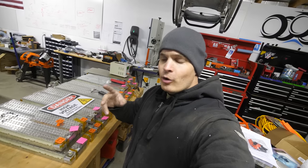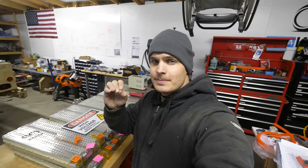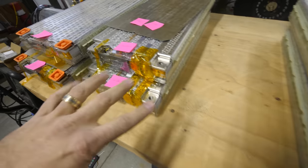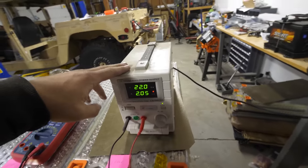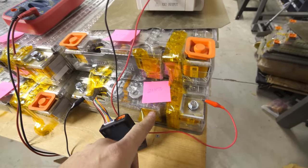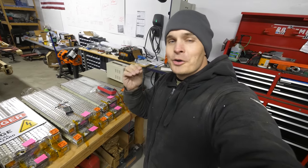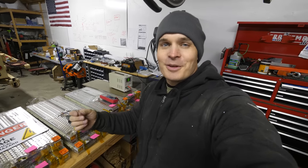We still need to make sure all of these batteries are within the same voltage range, which is an issue because I got them from two separate sources. The first batch were all 24.6 volts while the second batch of four batteries were 21.3. So we have a DC regulated power supply pushing two amps into a battery to bring it up to 24.6, while the cells are being slowly balanced. Fair warning — I'm not 100% sure this is the correct way to charge lithium-ion batteries.